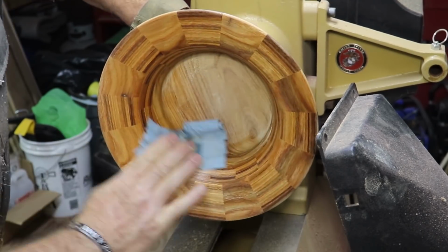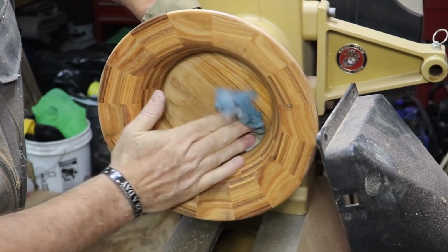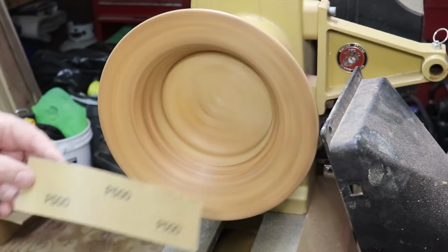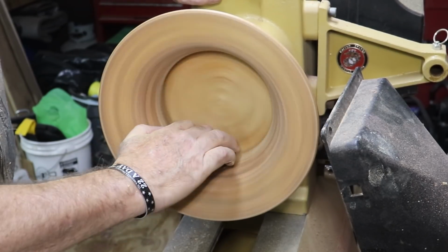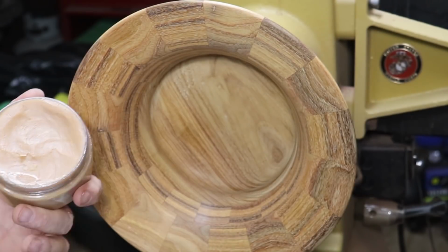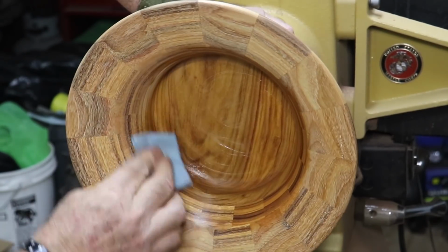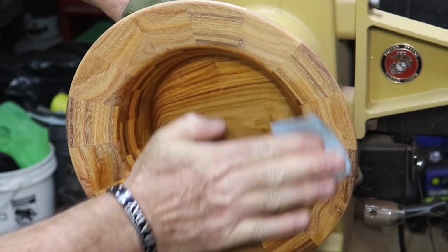I started sanding at 120 grit, went up to 220. This is denatured alcohol to clean it off some and raise the grain. And then I resand with 220 grit up to 500. And then I hit it with some Axe abrasive paste, followed up by the polish. And I'm not sponsored, I just like it enough to recommend it with confidence. It's good stuff, American made.